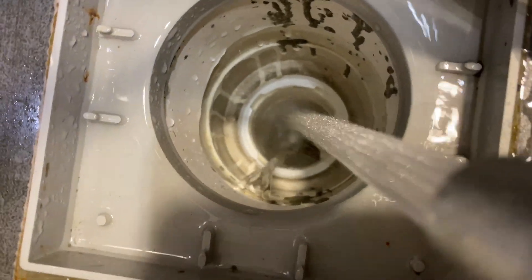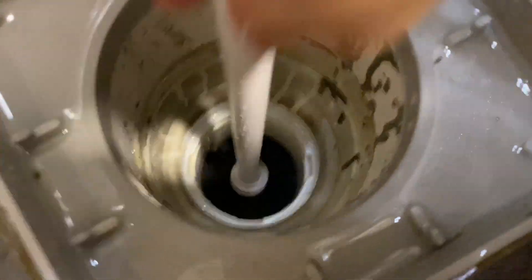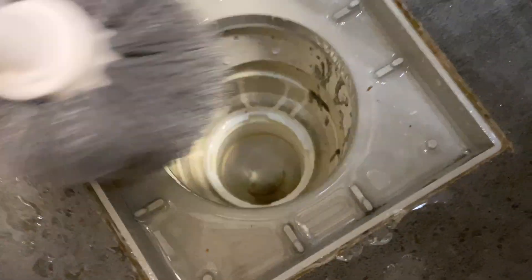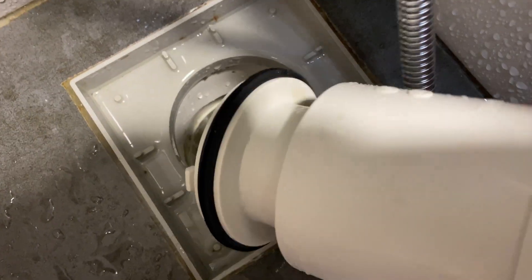The main idea is to use a mechanical machine to remove the cement stain from the inner wall, especially where the seal will be seated. It's now clean — as long as it's white and clean, I'm satisfied. If not, clean it again a few rounds. If you do not have a drill and an extension brush, you can use a toilet brush from your toilet. Make sure the rod is long enough. I'm satisfied now — that's what I can do.